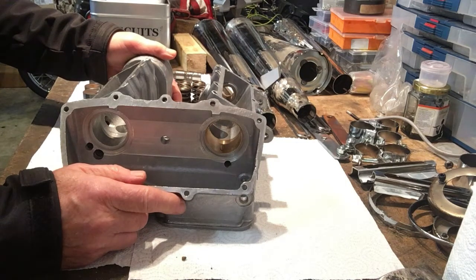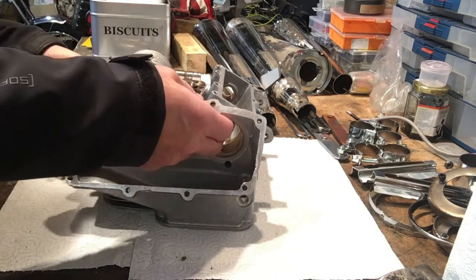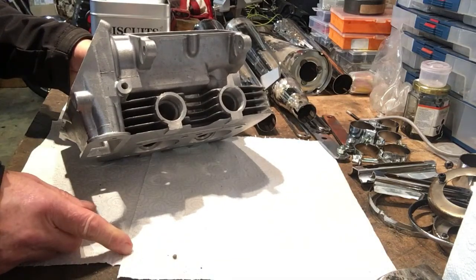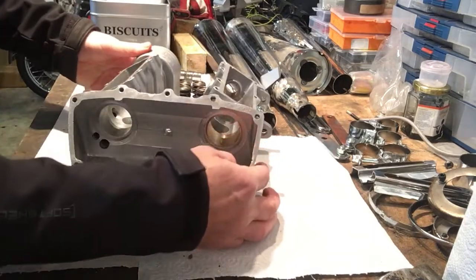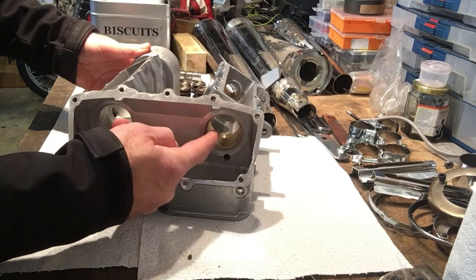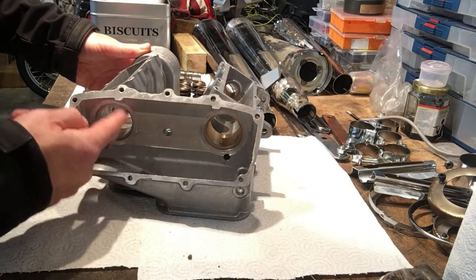well, it appears quite complex, but I'm sure it's probably similar to other overhead cam motors, in that essentially the way that oil is fed to the head is via a separate line from the crankcase, from an oil channel through the crankcase up into here, and then from the line here it's fed through a channel here and then up into the cam bearing, and similarly across a channel underneath there into the second cam bearing,